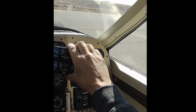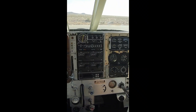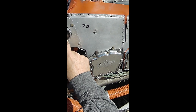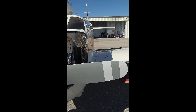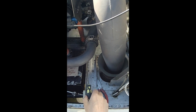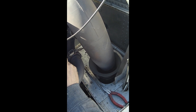Back to the autopilot issue — it's disconnected, the breaker's off, and yet it's veering the plane to the right. This is extremely dangerous, and the previous owner had warned me about it: if we connect the vacuum hose, the plane wants to draw to the right. Needles out, battery off — we're all good. There's a little bit of fuel on the ground, and I can see there's oil inside the instrument. What you saw was a pressure gauge installed by the previous owner because he wanted to make sure he was developing oil pressure. Indeed there is on that instrument, but obviously that can't stay there — it needs to be removed.